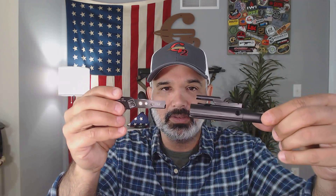My favorite part — this is the biggest pain to clean, especially where the bolt goes. Once that bolt comes out, we've got this hole. If you don't know the construction of the bolt carrier group, that hole is actually tapered — it's a little bit thinner toward the back. You get your Botek Battle Steel cleaner in there, slide it in, feel it hit the back, and then just turn and scrape all of that carbon from the bottom and back of your bolt carrier group where your bolt would be riding.